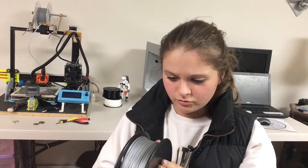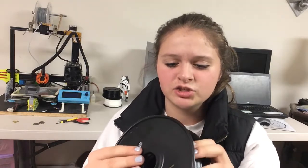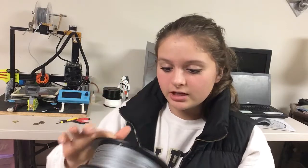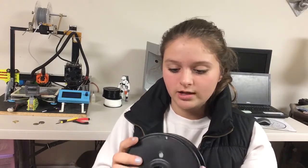Once this is off — this is a nice, smooth filament. It is not badly wound like the last one. As you can see, this is all straight, and this filament has a nice smooth texture to it. It's kind of shiny for the aluminum, and it is gray because it is aluminum. On the sticker here it says metal PLA, 1.75, color: aluminum. Temperature is only 210 Celsius and up, which is surprising. But I do have my all-metal hot end set up, so that should work really well. These spools are pretty plain.